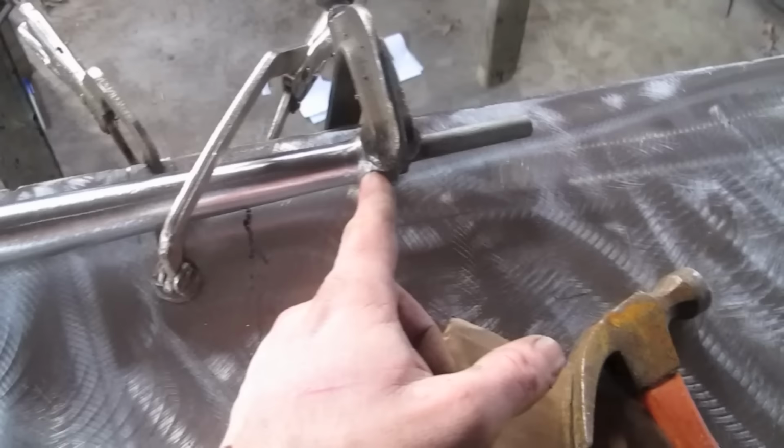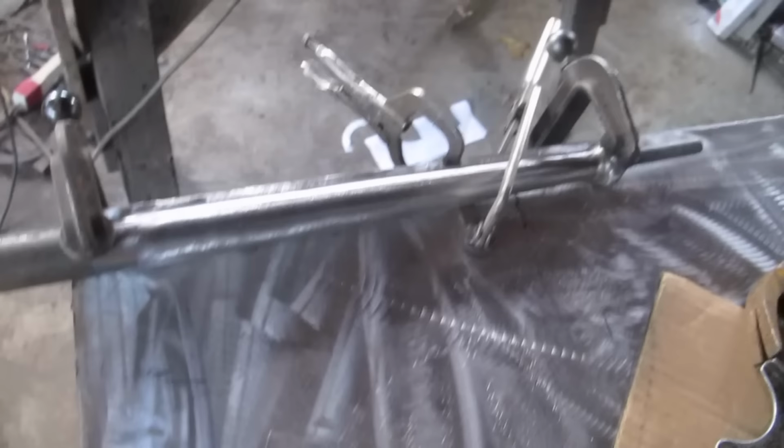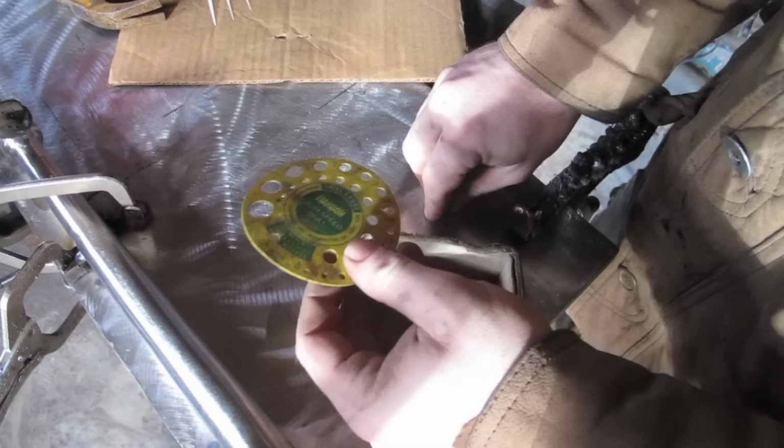But this thing here, welded on, will still ensure that when I put it on the table, rested on that wide piece here and rested on the original diameter here, and the sword's up here, it's still, in theory, lined up with the sword properly. I hope. I also have to drill 2 holes. Having this bit here will make drilling those holes easier. I like to use rivets to hold the bandages onto the handle. Kind of raggy things.